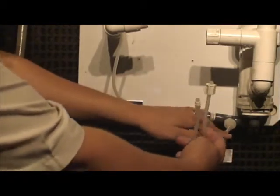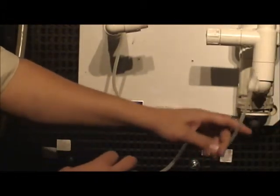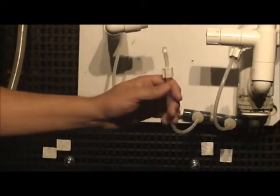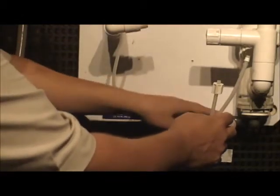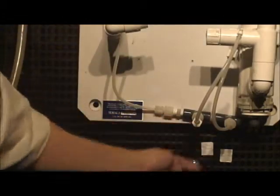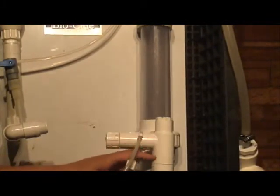Both of those two lines coming out of the Olas pump feed into these two T's, and then these two chemistries feed into the center cell of the Olas Ti. So you know these two lines there. Now I'm going to go over here to the center cell and pull it up just a bit. Apologize for the moving. The two tubings' solution goes into the center cell right at the base here, and then it starts to mix and create chlorine dioxide, which is really neat with these brand new units. I'm getting in real close because I want you to see that center tubing that I'm talking about.